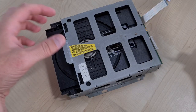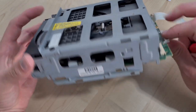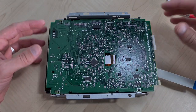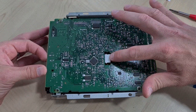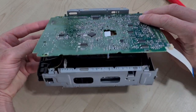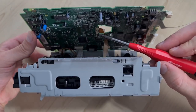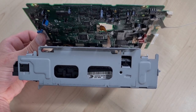So this is the left-hand side transport, absolutely manically covered in dust. The only thing I can see to start with is to try and remove this metal shroud off the top — that's four screws underneath. Let's pull these four screws out, all identical. This is obviously a ribbon connected to the chipboard that needs to be extracted. There's no actual way of lifting this up — that's the laser connector. We have the usual little black pull tabs here.